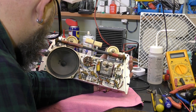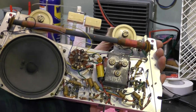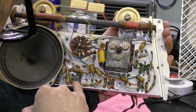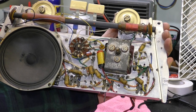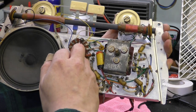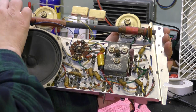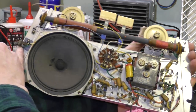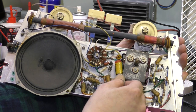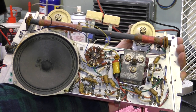That's the other side of the chassis. More waxies! 150 volts - I don't suppose they leak very much at this low voltage. There are quite a few waxies here. I'm just surprised at the amount of waxies in this from 1963 - I sort of thought they'd stopped using them by then. Plenty of tarnish on that; I think I'm going to have to give it a good clean. It's out and in one piece. The jack socket is well rusty - going to need a little bit of work. And more Plessey capacitors - very popular, I remember seeing them in television sets and all sorts.